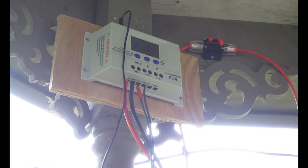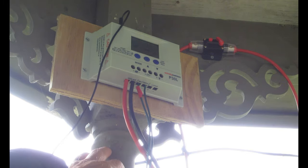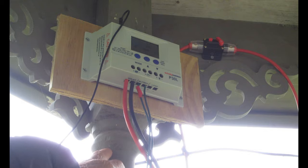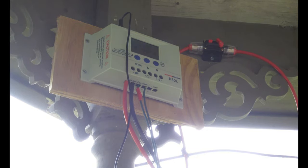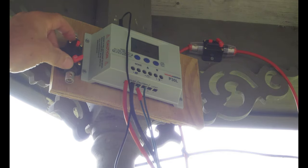I'm going to figure out where to put my fuse — probably somewhere on this post. I'll cut the wires to appropriate length and strip them. I've decided I'm going to put my circuit breaker right up here, fix that there, strip the wires, cut them to appropriate length, and run it to my charge controller.